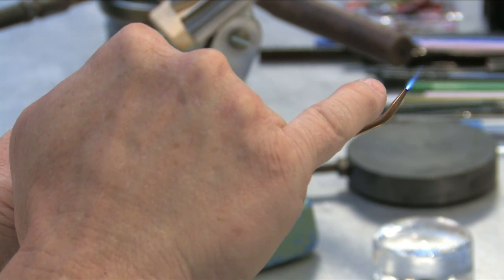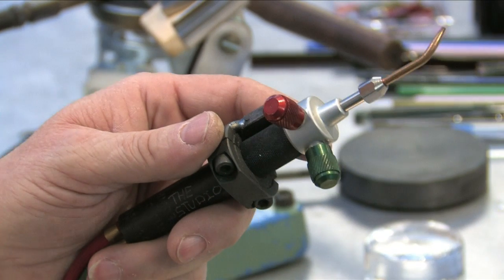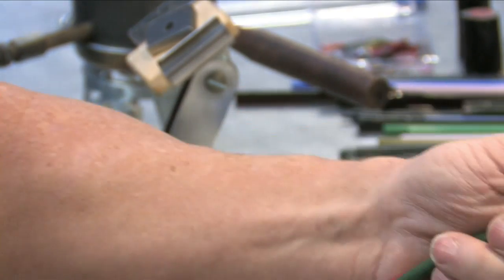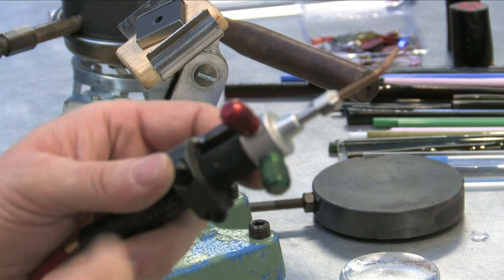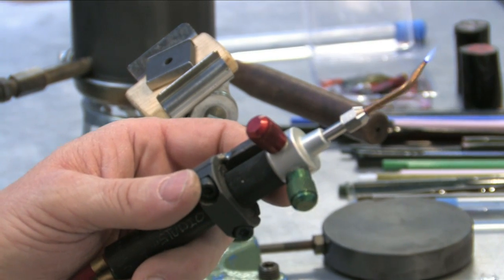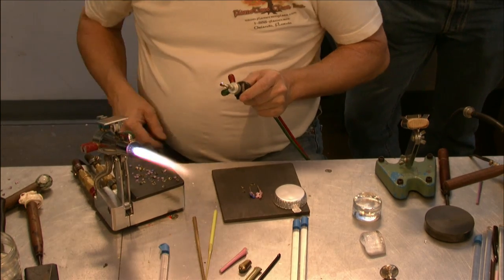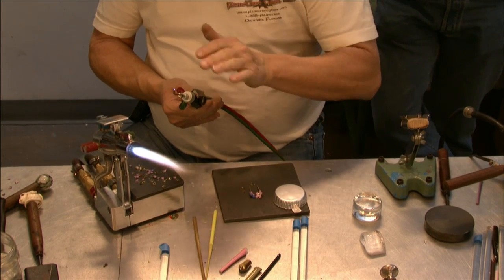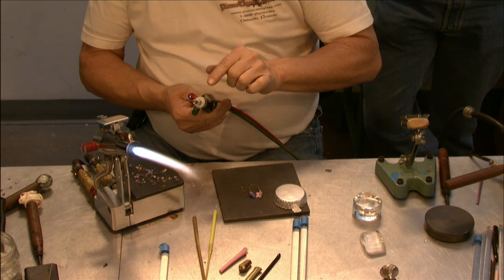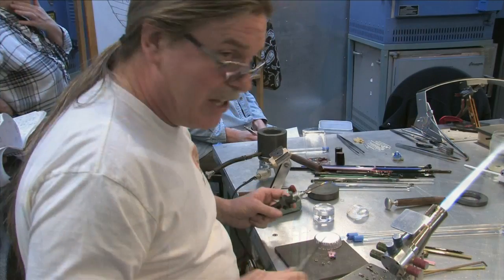And the point is very, very tight. You have to take it to that point, and it's actually just before it goes out. Right on the very, very edge. So a torch like this, an internal mixed torch, usually cannot even be taken to an oxygenated flame. By the time you get it to an oxygenated flame, it blows itself out. And that's the same way with many welding torches and that kind of thing. So you've got to take it to that perfect purple, right to the edge of the line, and that's what you use. You can see it's a nice little teeny flame, but believe me, this is hot. They claim that this flame, with acetylene, generates a 6,300 degree flame. 6,300 degrees. Okay, so let's get hot.